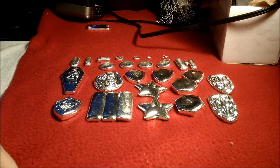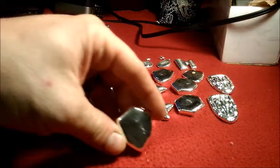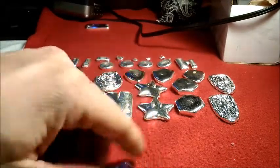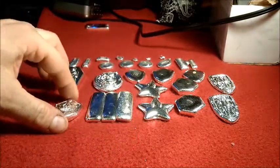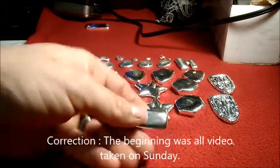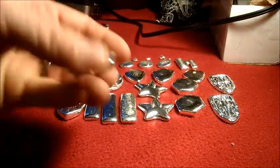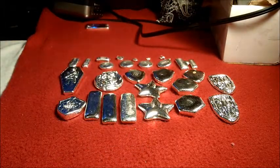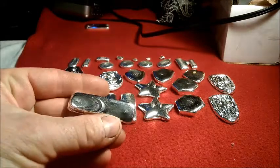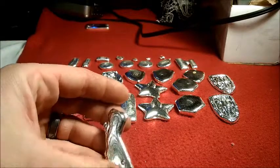Here's what I ended up with for the day and evening — my version of silver shot. None of these actually ended up getting stamped; I ran them through the tumbler probably too long and lost the pour lines. I'll hang on to these at least until the weekend and try to get this video up as soon as possible. You can see how worn out all the pour lines are compared to something like this one I did a couple of weeks ago, or the one I did Saturday trying out the new mold. I didn't leave that one in the tumbler as long, and you can still see it's not quite as defined as a typical pour — even this one I probably left in a little long.